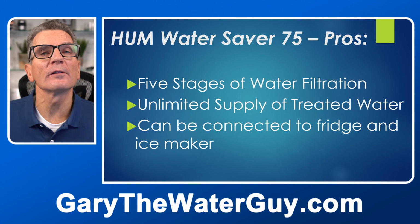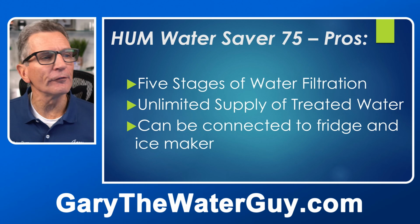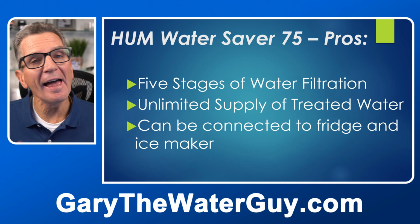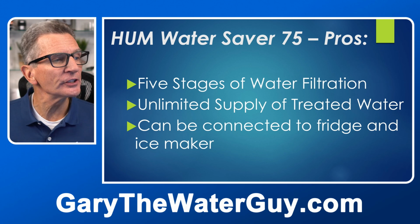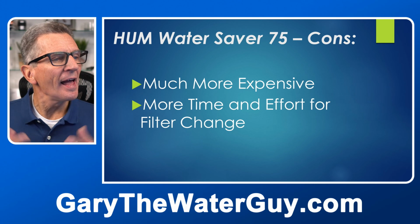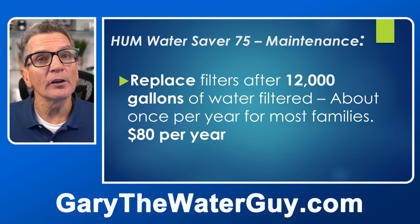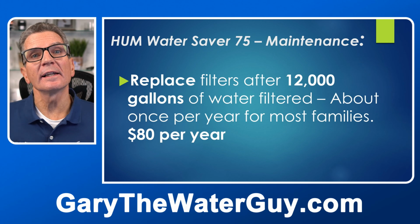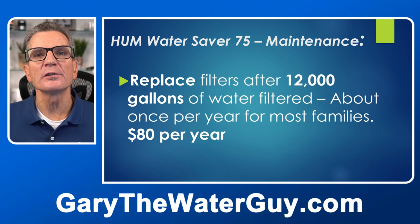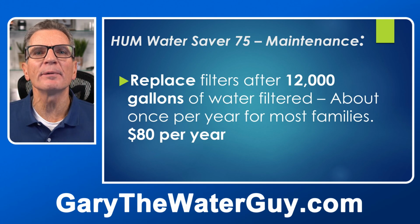So when looking at the pros of the Hume Water Saver 75, we can see that it has 5 stages of water filtration. There's an unlimited supply of treated water being produced, and it can be connected to a fridge and ice maker. The cons are that it's much more expensive than the Brita, and there's more time and effort when doing a filter change. And when we look at maintenance of the Hume Water Saver 75, we see that the filters need to be replaced after 12,000 gallons of water usage, typically about once per year per family. And the total cost of those filters is about $80.